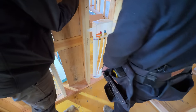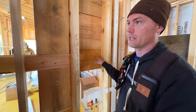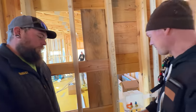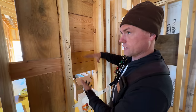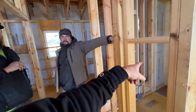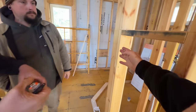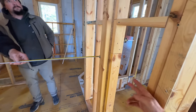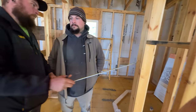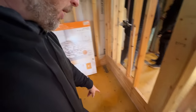I might just come across, angle straight down, drill right there, and then get to the shortest exit that way. Also right behind this is a double oven, so we've got to get a box in there that doesn't interfere. I'm waiting on the specs because the cabinet sits about this high and then the oven's about yay high, so the outlet is going to be somewhere in there. We're looking at light switch placement here for the master bath. I've got a 36-inch door — the hinges open here — so I can't get a switch there. Also here is just bifold, so I can't put a switch there.